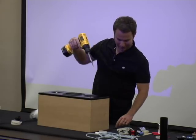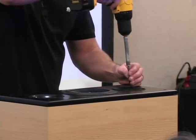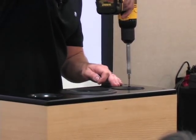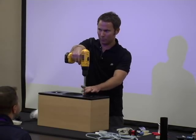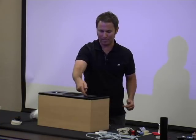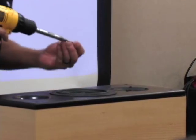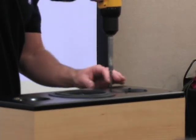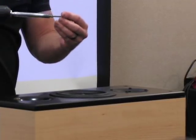I've already drilled pilot holes. Paying close attention to how far I'm putting the screws down — I want a perfectly flush look. With the foam tape in place, the driver is sitting up above flush on the baffle, but the gasket tape allows us to bring it down to exact flush. Good for performance on the tweeter and also for looks. Only six more screws to go and this thing will be up and running.